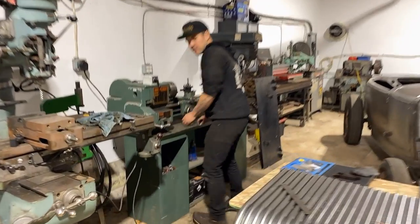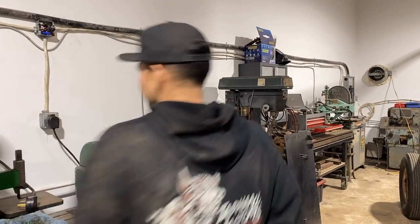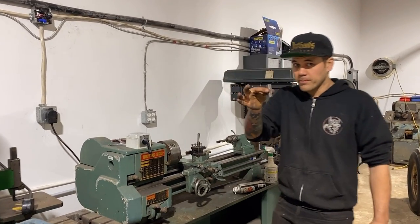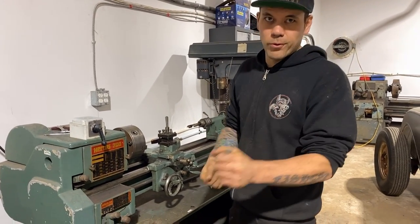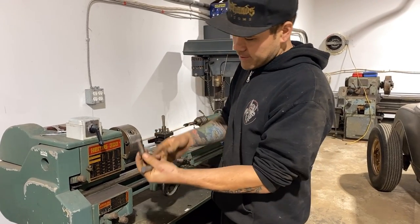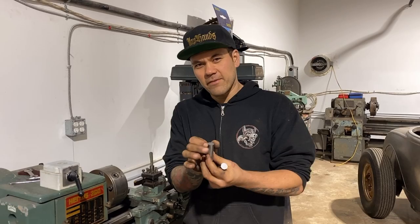We've got some cold rolled 3/4 inch round bar. So I've got a 2-inch piece for the bottom and a 4-inch piece for the top. 4-inch just so that you can hold it and smack it with a hammer. A little 2-inch one. I like that it's only 3/4 inch wide, because if I'm doing a flange on a bead rolled door panel or some kind of interior piece, bomber seats, whatever, I usually use a 3/4 inch flange. So I don't want to go much bigger than that.